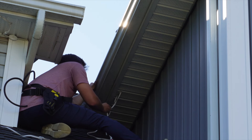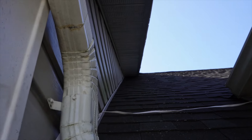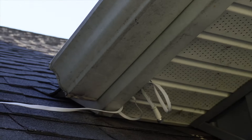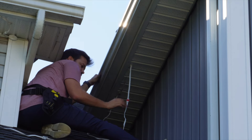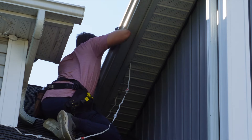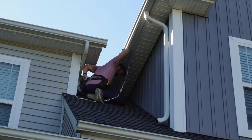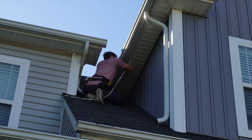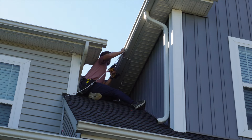The first thing I had to do was run the wire from where it came out of the soffit over to the peak of the roof where I was starting the lights. I made sure to tuck the wire into the siding, particularly the corner and edge covers, to keep it completely out of sight other than the portion that jumps from one side of the roof to the other. I covered that part with black gorilla tape to make it blend better with my dark-colored roofing. Once I got to the starting location, I tucked more wire into the soffit edges and up into the attic, then wired in the light portion of the run. Since this is one giant strand, be careful about where you're placing it so you don't have too much weight yanking your lights down.